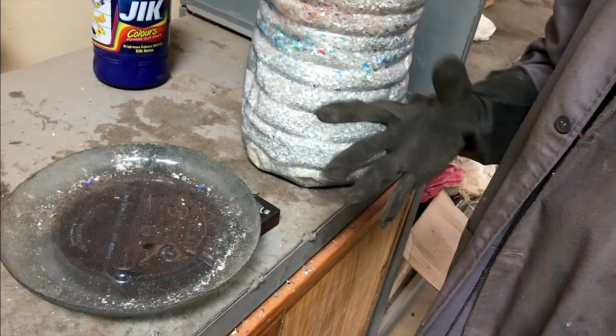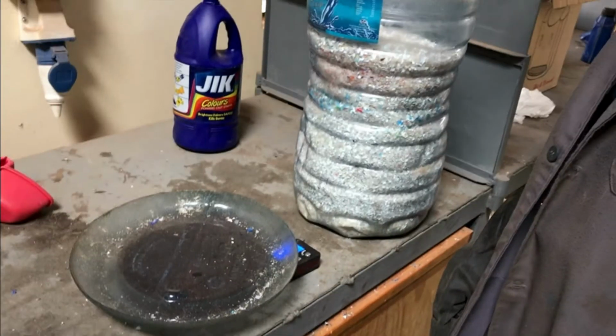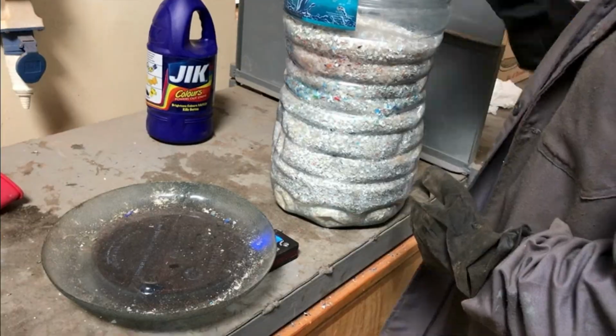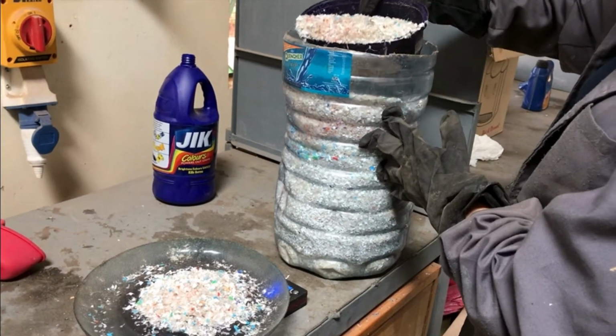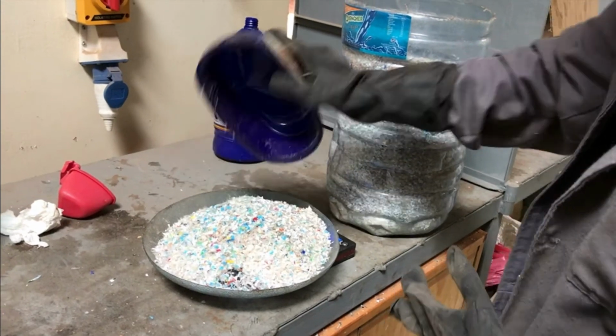The first step is to measure out the needed amount of grams for the filling of your tray. For HDPE, a tray typically takes around 1000 grams of the shredded plastic. Use a thin or light container to weigh out your needed amount. It does not have to be exact, but as close to the needed weight as possible.